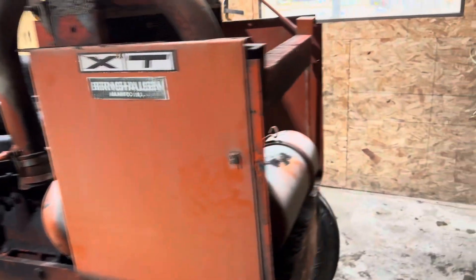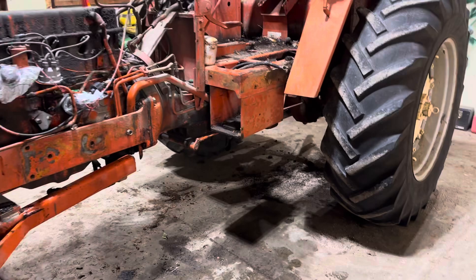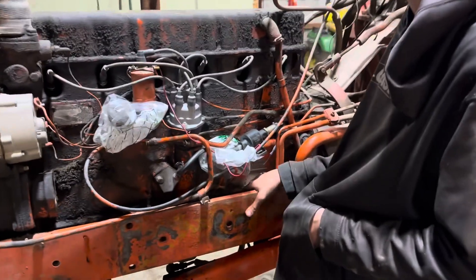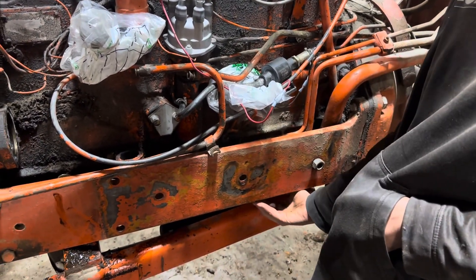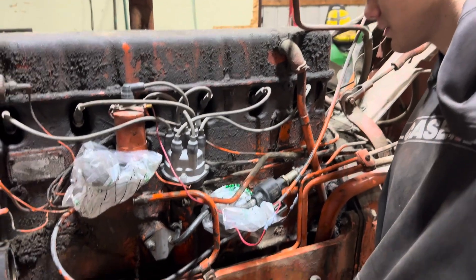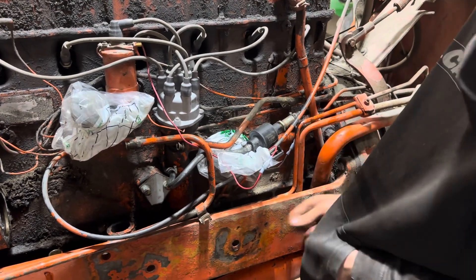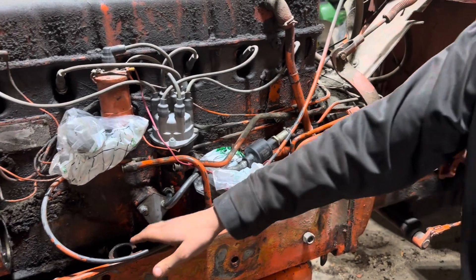Anything else you want to mention on this hydraulic pump rebuild? This thing also has, underneath it, an oil cooler — it actually has a separate oil cooler right under it. So you have to disconnect a bolt in the oil pan that holds one of the oil pan holding bolts, and then you've got to loosen all the clamps for all the rubber fittings on it, and then it just kind of pops right out — slides out.